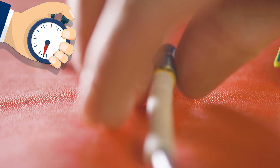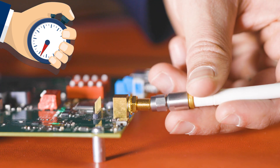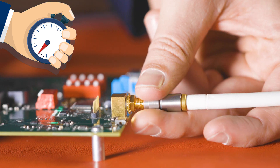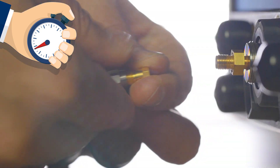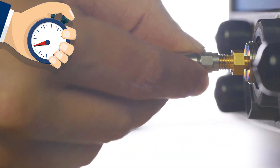Number four, discharge your cables before connecting them. First, make sure your device is not powered on, then connect your cable to that device, then attach a 50 ohm shunt or short to the end, and finally remove that shunt and attach the device to your gear.